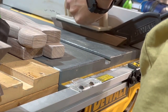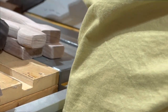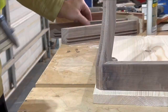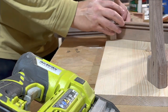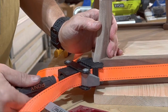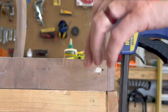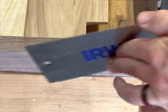Make sure you pop all your bubbles and let's get back to the table legs. Now we're cutting grooves with the table saw for the box lid — to slide in and out to house the phone charger cable. See the walnut legs there. Use some pin nails to hold it in place along with glue, and then we'll come back and add the maple dowels or pins. I apologize — I didn't film drilling the holes for the maple pins. I didn't realize I wasn't filming until I got to the point of cutting off the overhang of the maple pins, which is slightly irritating because I was somewhat impressed with the method I came up with.